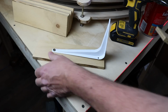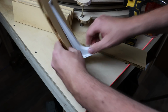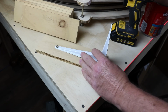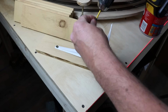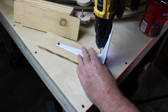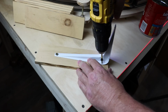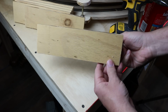You will note that I'm using another block of wood to help me line them up correctly with the back of the bracket. These cleats are 10 inches long, the same as the width of my bench work. I am attaching them to the brackets using 1/2-inch cabinet door screws. There's nothing special about these screws except that I once had an entire coffee can full of them, so I've used them for various applications that needed short screws for many years. I attached these cleats to all of the shelf brackets.